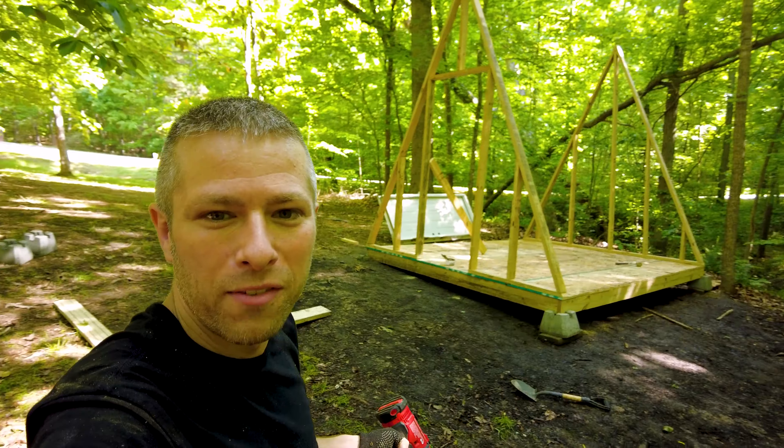We've officially got our top pieces of plywood on there. Now that I've got those top two plywood pieces on, it can only mean one thing — it's time to do the middle section. The hard part is balancing this thing by yourself while screwing it into the boards. We're going to screw boards periodically up the side of the plywood, and the reason for that is because the metal roofing material we're going to use — we don't want to screw directly into that plywood.